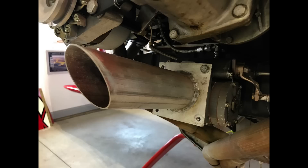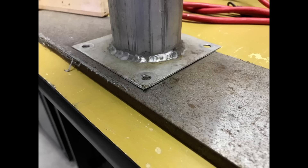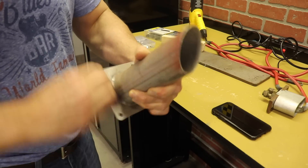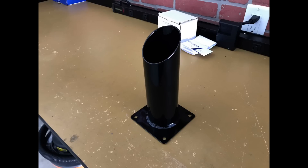The next thing I wanted to do was beautify the air intake tube on the front of the engine. I wanted to remove this piece, clean it up, and reinstall it. The first thing I noticed is that it doesn't sit flat — the bottom flange is a little bit bent. That was pretty easy to fix; I just took a hammer and beat it down a little. I also filed down the sharp 90-degree corners on the aluminum to make them nice and curved. Then I scuffed up the entire tube to clean it up and had it powder-coated. Now it looks beautiful and is ready to reinstall.